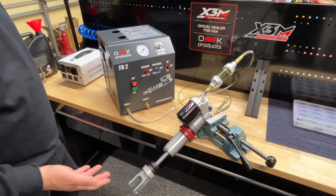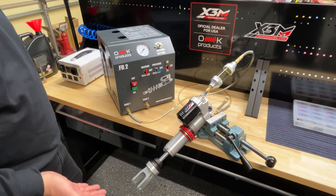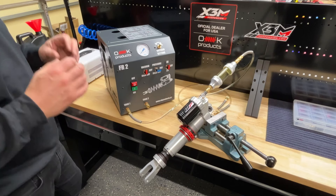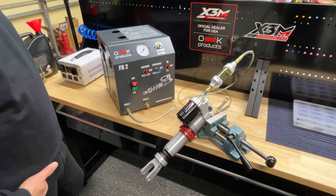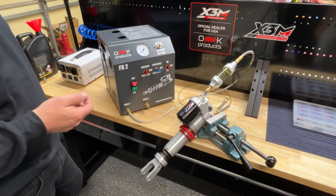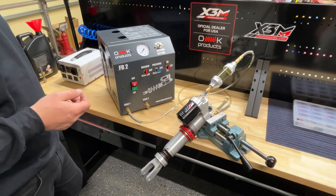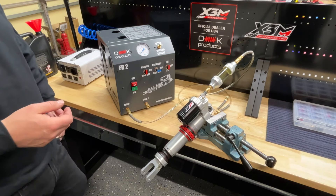You can see now it's fully filled. It's usually a good sign when the shaft gets pulled nicely and slowly inside — the shock is properly bled. You're usually going to see some bubbles coming up because once the piston is forced in, it creates some bubbles. Watch this on the separator for around a minute or two. Once the air gets cleared, we're going to switch the pressure and fill it up again.